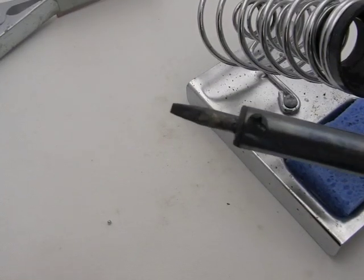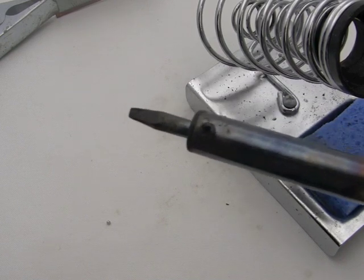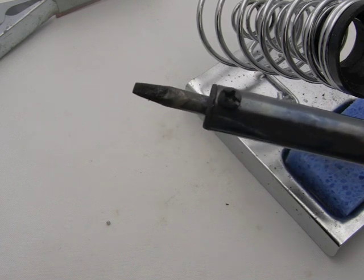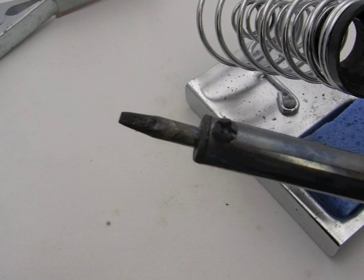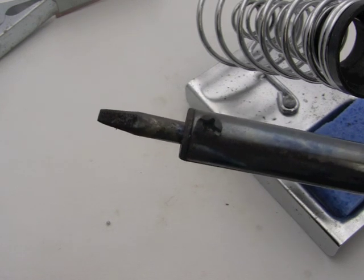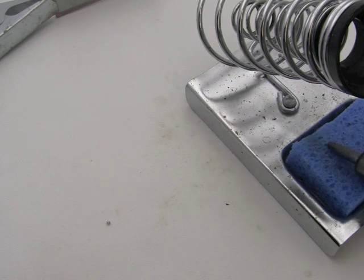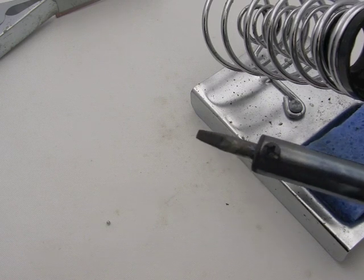Alright, so here's that iron. I turned it on and heated it up. It's got that blackened tip. You never want to leave your iron on sitting idle. If I left this on five minutes and came back, it just bakes on any oxidation or residue and burns off that nice coating on the tip. Big no-no. So as soon as you turn your iron on, sit there, wait for it, test it on the sponge - it'll sizzle and you'll know it's hot enough and you're ready to start soldering.